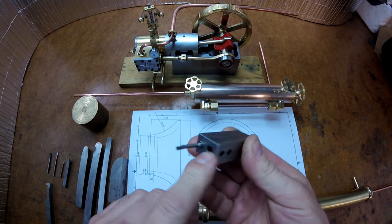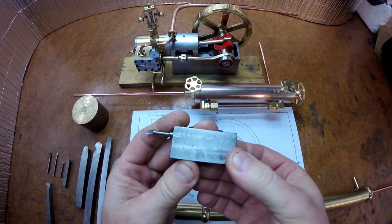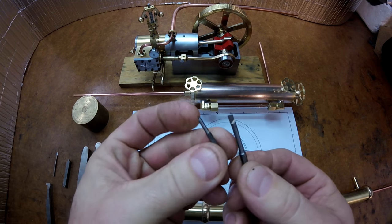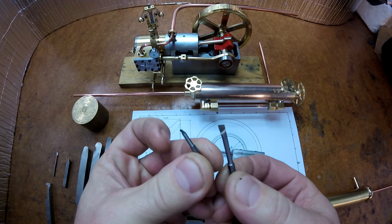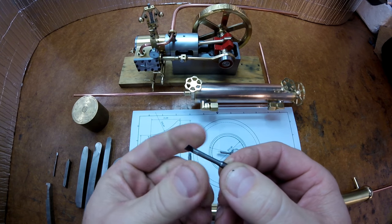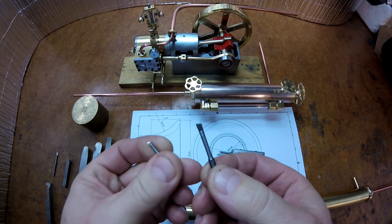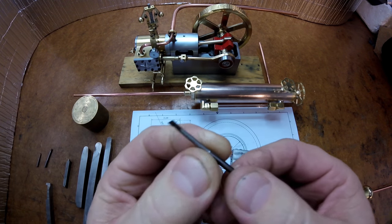And you'll see I just have a number of different size holes, so I can just fit them in there, and then this goes in your standard tool holder on the lathe. You'll see I use a lot of different sizes. Instead of drilling, I'll often drill and then bore small holes to size. Even instead of using reamers, I find I get the exact size I want, and it always runs concentrically. You never get any run out like you can when the drill doesn't necessarily want to follow the centered hole. Now there's a longer version that I've made previously.